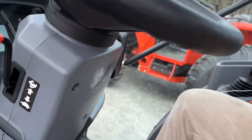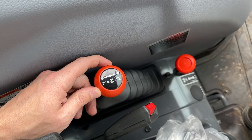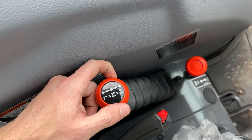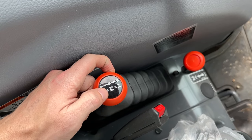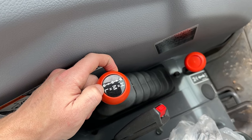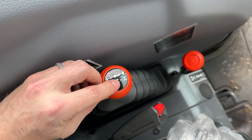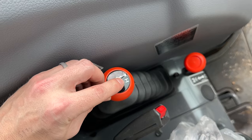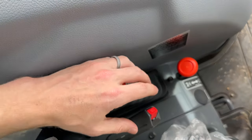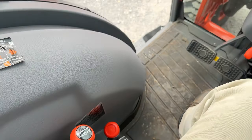The Grand L technically has a six-speed transmission. This knob is your High, Medium, and Low range. High is for highway speed — moving fast from one side of the property to the other. Medium is for mowing work, pulling a bush hog or finish mower. Low is for heavy-duty loader work, heavy pulling, or running a tiller. I always recommend staying in medium range unless you need to go fast with nothing heavy on the tractor.